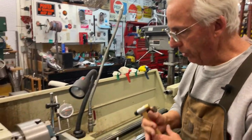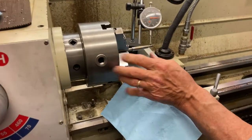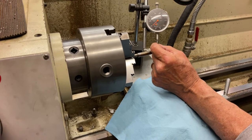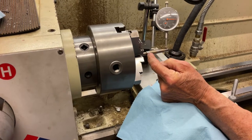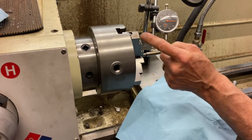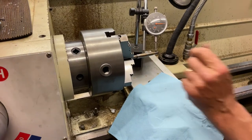What I've done is I've hooked up my dial indicator, and you have to have a lathe to do this — you can't do this at home. I've used the dial indicator, and these things move like that, tells you the runout. And I checked in here, so the bend is in here, it's not right here. So I can move the shaft back for support, because these jaws are real long, about like that. It's gonna hold it in place while I bend it back into place.